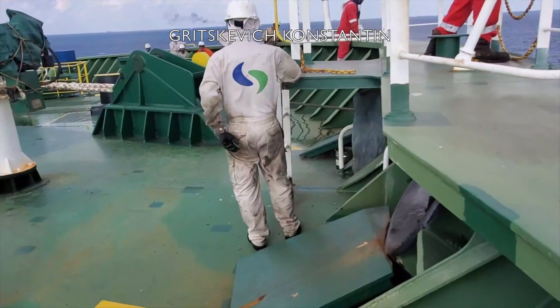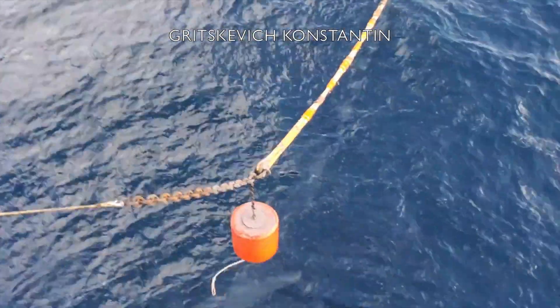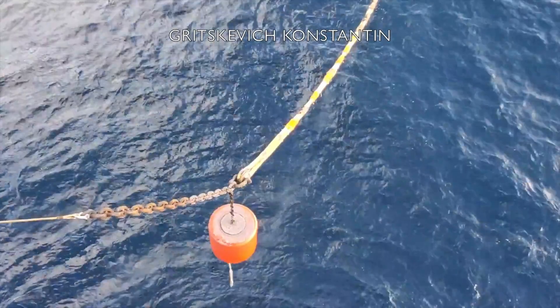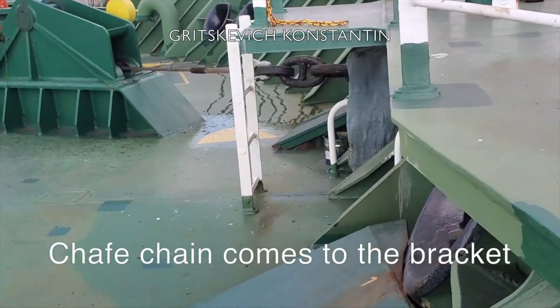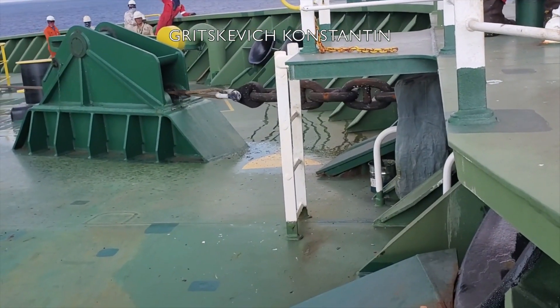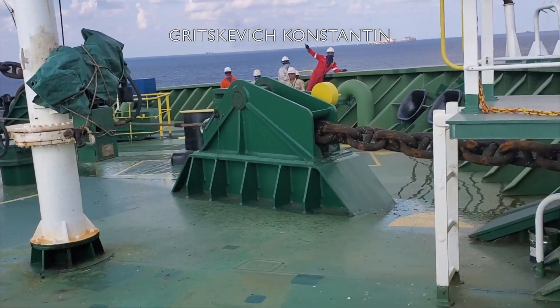The vessel should be brought to a dead stop between 45 and 60 meters from the buoy. At this point the chafing chain is lifted into the bow chock and then to the bow chain stopper, to be secured under the direction of the pilot. The mooring master or chief officer reports the distance and position of the SBM in relation to the vessel to the bridge during mooring operations.